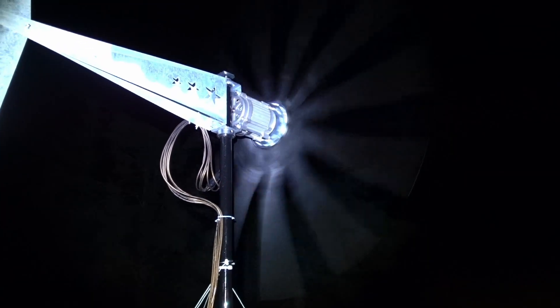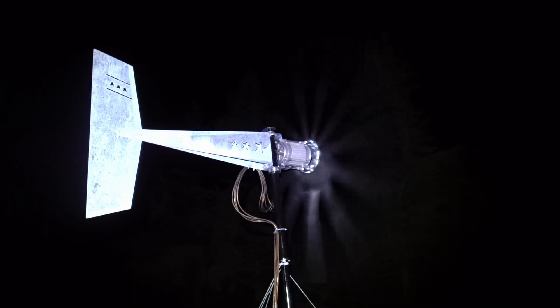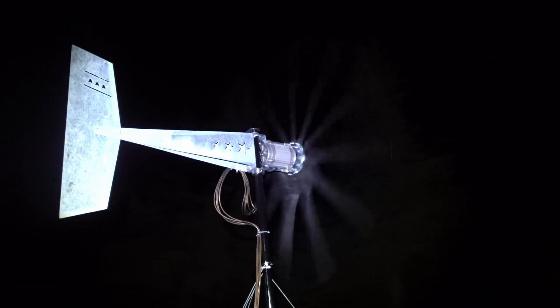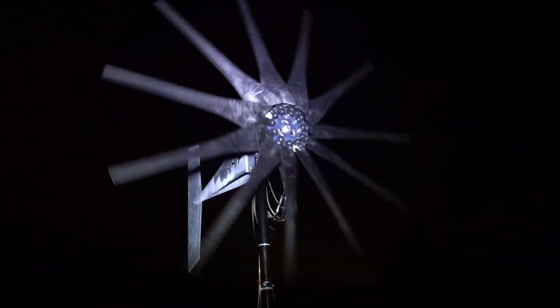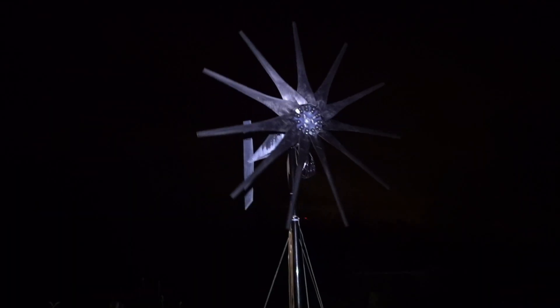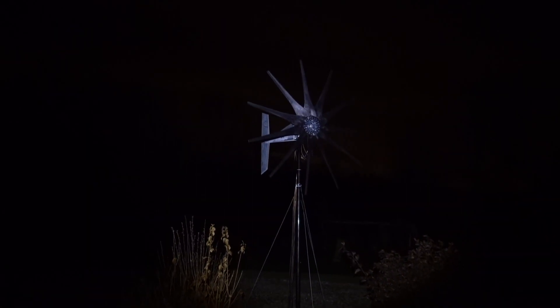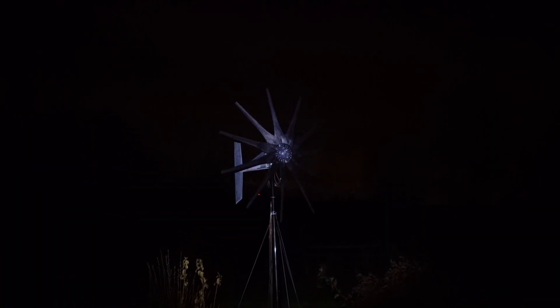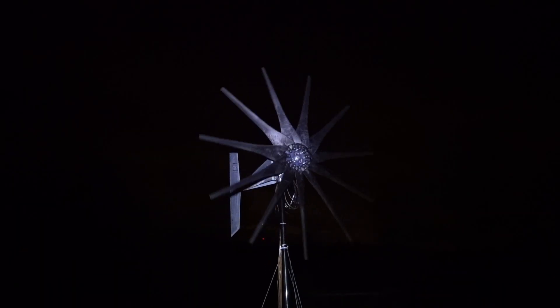There's a decent gust — spinning pretty good. I get up to like 200 volts but then just like that it calms down and it's not spinning very fast. It might even stop — and it stopped. So I'm wondering if MPPT, at least with having it on such a low tower, is actually not the way to go because it's too sporadic and it doesn't track fast enough — that's what I'm wondering.